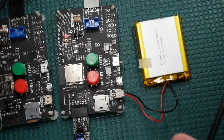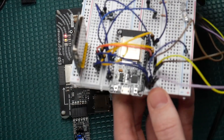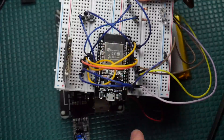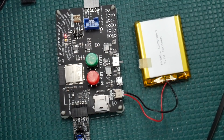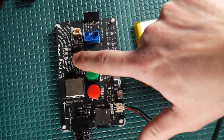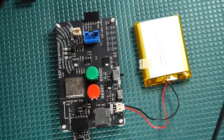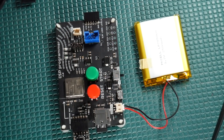The board is based on an ESP32. My first prototype was just a cheap NodeMCU board with an SD card breakout — nothing fancy. We'll pull up the schematic and I'll show you all the connections, but let me give you a quick demo. So let's pop the micro SD card in, hit the reset button, and away it goes. Once it's finished, you see the green LED flashing — it wrote four files to the SD card.